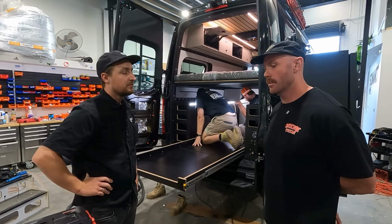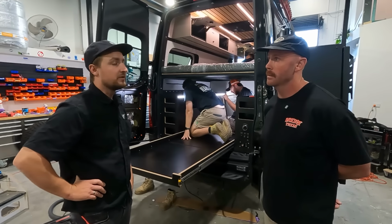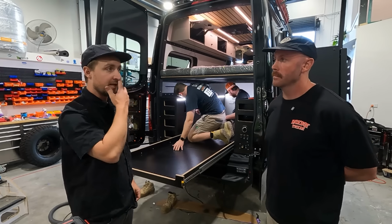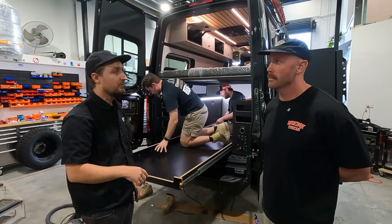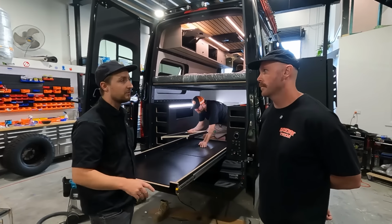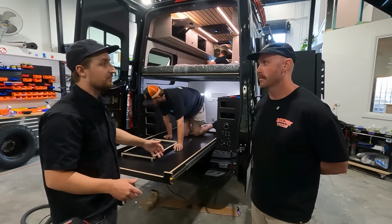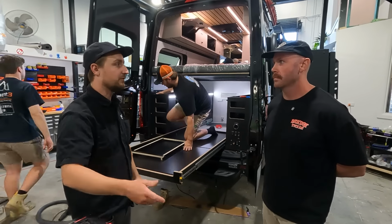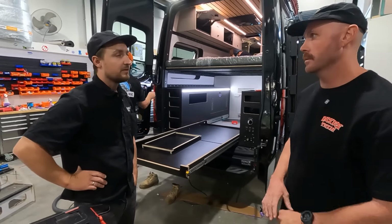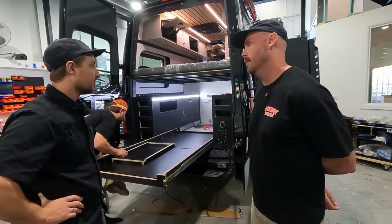In many vans, we opted for that Brown Davis long-range tank, though we haven't honestly done one since your van, but we just spec'd a van up today with a customer who wants it in a long wheelbase. The trouble with that, I find, is mainly the GVM. By the time you're speccing up everything with an additional 100 litres of fuel, essentially you lose 100 kilos. It blows out the GVM, especially on a 4 series. That's right, so you do just have to be a little bit mindful.